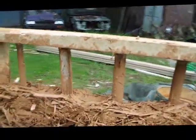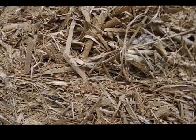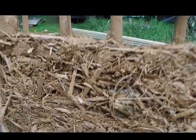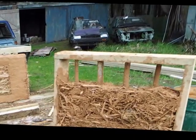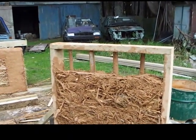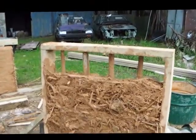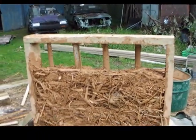This first surface is a scratch coat — it reveals the contour of the wall that you have to work with. Even a wall like this is going to scrub up. We're going to put our clay slurry and chopped vetiver. First, our primer is just a pure clay plaster with no sand, no chopped fibre. That creates the bonding surface for our fibred clay.